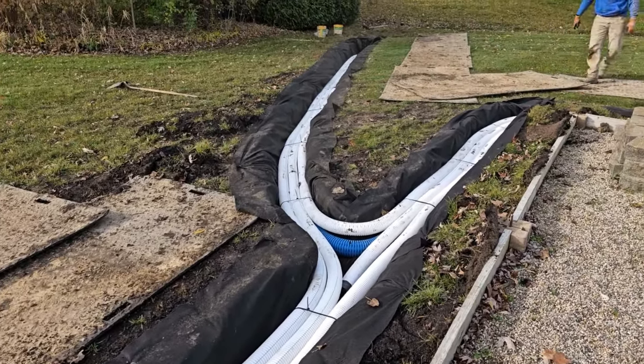What an amazing system. The air pocket that this creates — we always tell the customers: no non-woven geotextile filter fabric, you're going to have a failed French drain. One-third of the drains we put in are to replace failed drains, so we know what failure looks like. It looks like a French drain that doesn't have non-woven geotextile filter fabric to separate the subsurface soils from the aggregate.